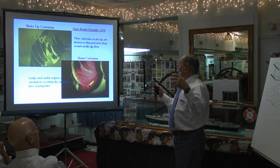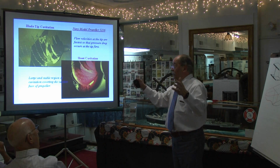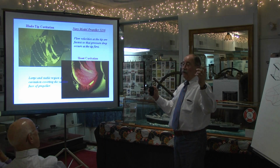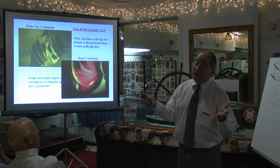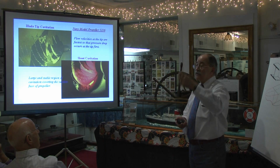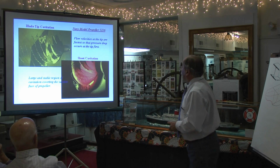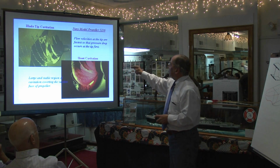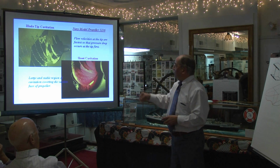And instead of nice and smooth cutting through the water, now they're rough. And now the cavitation starts at a much slower set of revolutions, because instead of a smooth blade, now it's rough. And it's just an ongoing process, it just gets worse and worse. And that's why the SS United States had 2 sets. They had to change out the props at every dry dock, because she had so much power, she was just chewing up the props. And they were very expensive. And in the worst case scenario, down here in the right hand corner, you'll see a sheet cavitation, where the cavitation is produced not only on the blade tips, but all over the area of the blade itself.